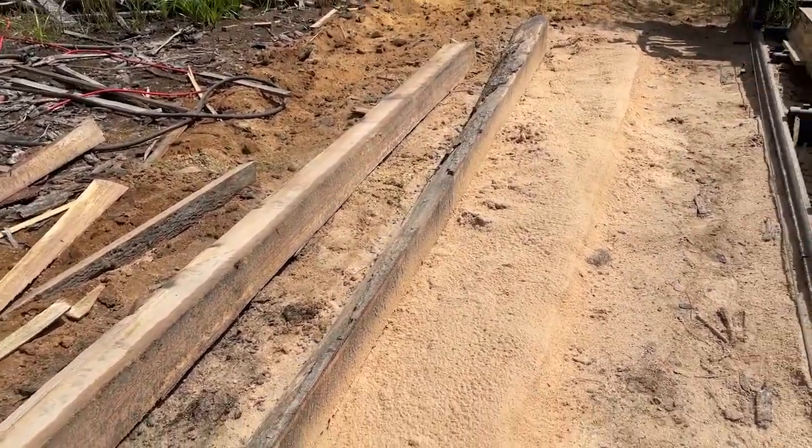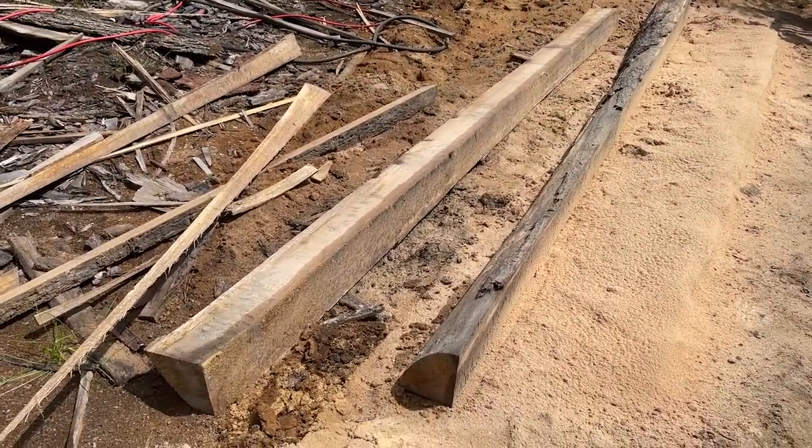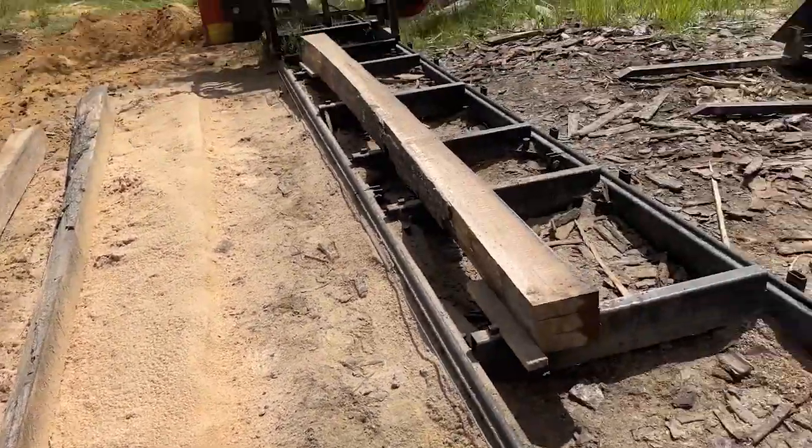So those will get stood up on the, I guess you'd call it the proper 45 degree for a quarter saw, but that actually worked well. That was awesome. Okay, so was it worth it to quarter saw the log, the big red oak here?